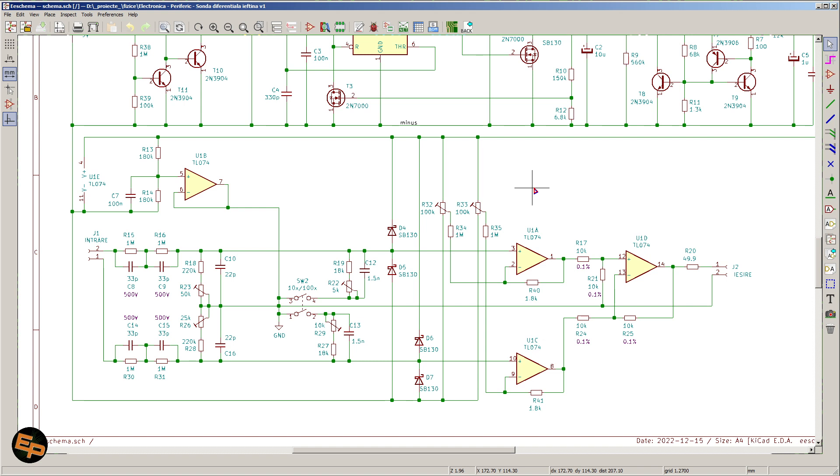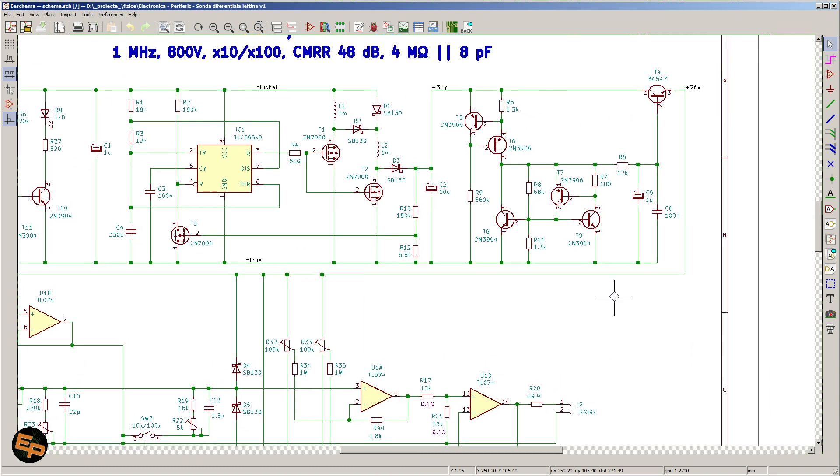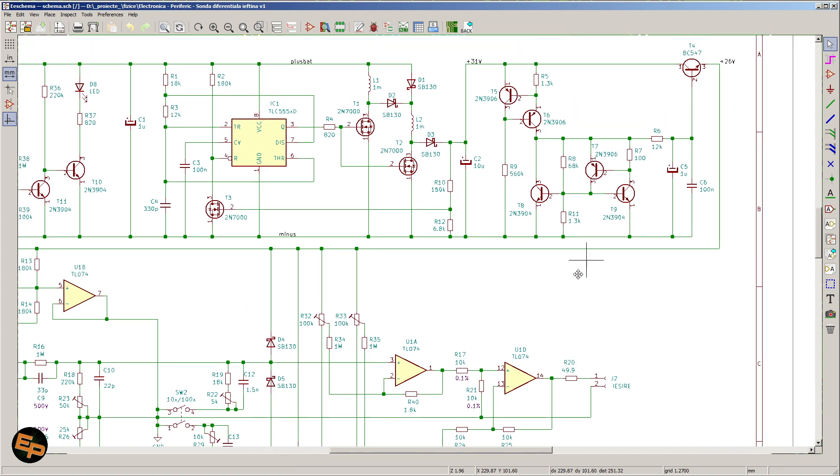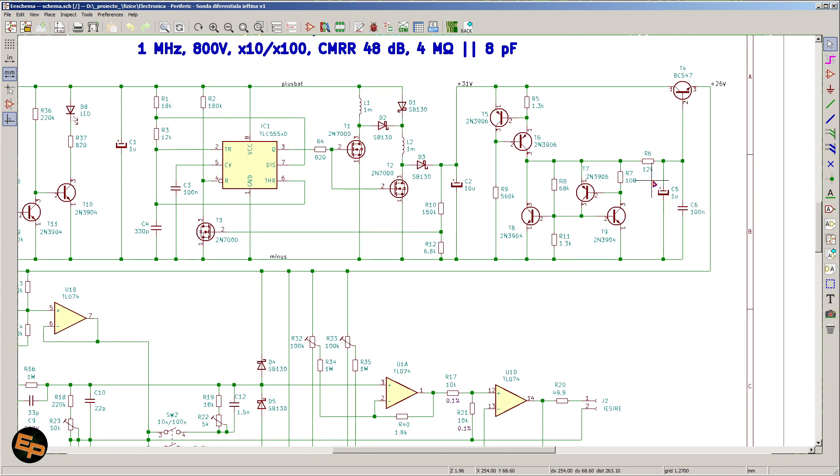These two signals would then be sent into a differential amplifier — the second half of the instrumentation amplifier — which gives us the final signal that can take both positive and negative values. So in order to have both positive and negative, we need a ground somewhere in between the positive and negative extremes. The problem is from this power supply we only get one voltage, so we need to create this ground.